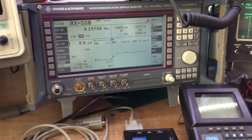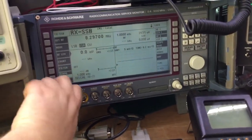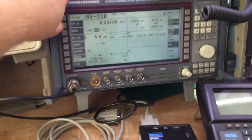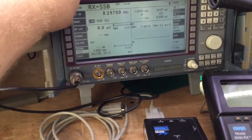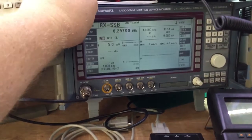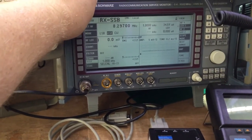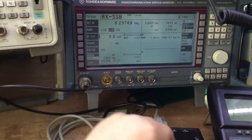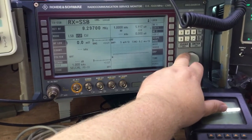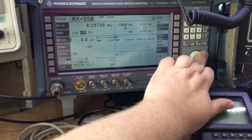Oh, that does help, doesn't it, when you plug in the RF port on the radio test set. So here we are, schoolboy error, not plugging in the RF lead. So that would be CW mode. LSB, obviously we're not on LSB on the radio, we're on upper sideband, so obviously we wouldn't expect an LSB signal to be received. And then we've got upper sideband as well. And we can test the receiver sensitivity in microvolts, how sensitive a squelch is, and do all kinds of testing.